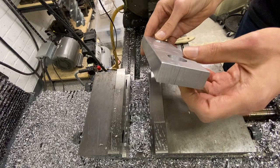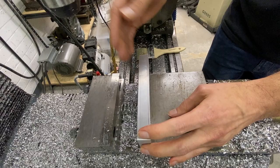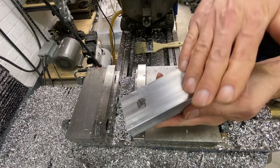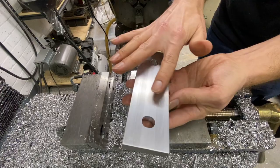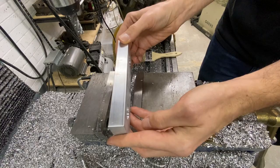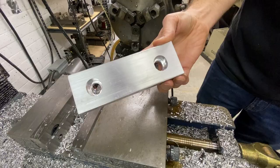If you want to make the jaw very repeatable over multiple installations — for example, if you run a part every couple months in batches — you might want to face the back and bottom so you have a consistent reference point for the jaw itself, which translates to your part when machining. Generally this extruded stock is pretty good, but it's not super flat, so there's a possibility of it rocking or installing slightly differently each time. Generally we leave it rough. I would make up a batch of maybe 10 or 20 of them — that'll last a couple months, and then when you need to, you just run some more.